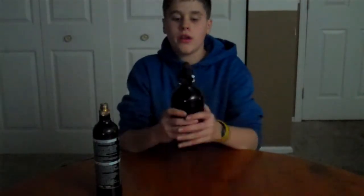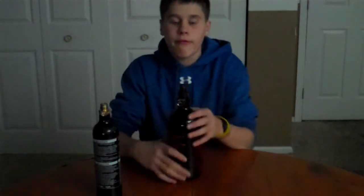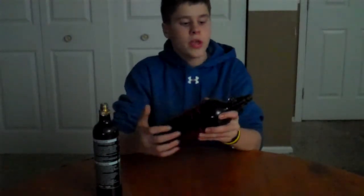That's a big thing — you can figure out when you need to refill. And you can also refill compressed air at your house much easier. I have one 4500 PSI firefighter scuba tank I got from my father and two 2500 PSI scuba tanks. You can invest about $30 to $35 in a scuba tank filler and fill these all the way up. I'll post a video on how to fill these up.